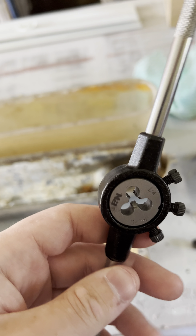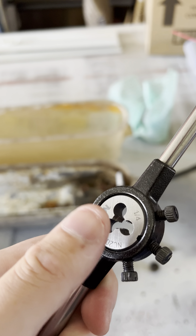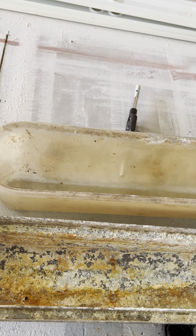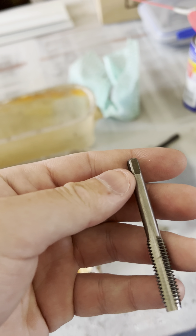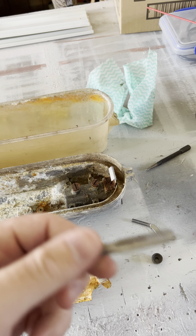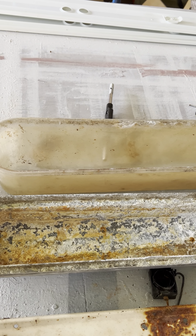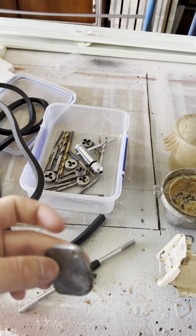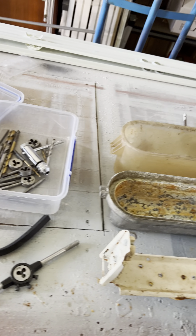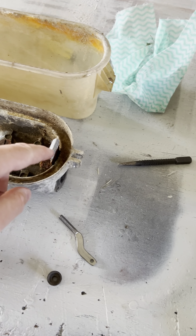I also did that with the previous Zodiacs and the Watt Ray and a couple of Peerlight fittings — they always have quarter-inch imperial threads. These screws here are 5/16-inch, and if I can ever get them out I can use a tap to recut the threads. All these used imperial threads. When I put these back on I'll be using M4 screws — I'll drill and tap new threads into the holes to accommodate them.